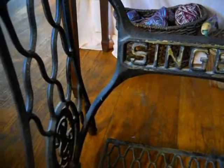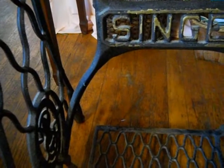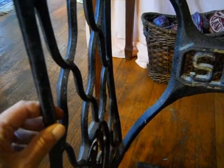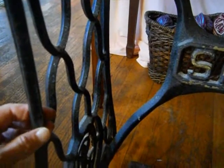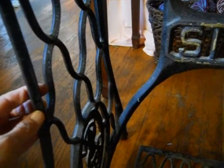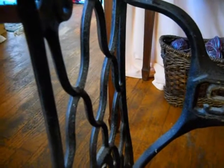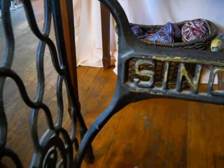This is dusty and dirty. What I'm going to do is take regular sewing machine oil — I happen to buy it by the gallon — and put it on a rag and wipe down the whole thing. I'm not sure if it's wrought iron or cast iron, but I'm pretty sure it's done with a cold cast welding process. Because we're talking about iron from anywhere from the late 1800s onward, these can become delicate — they can break or snap because they're old.